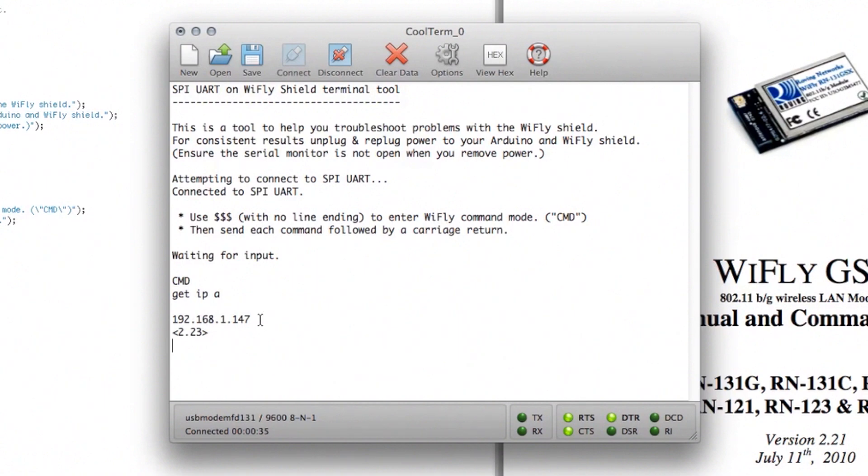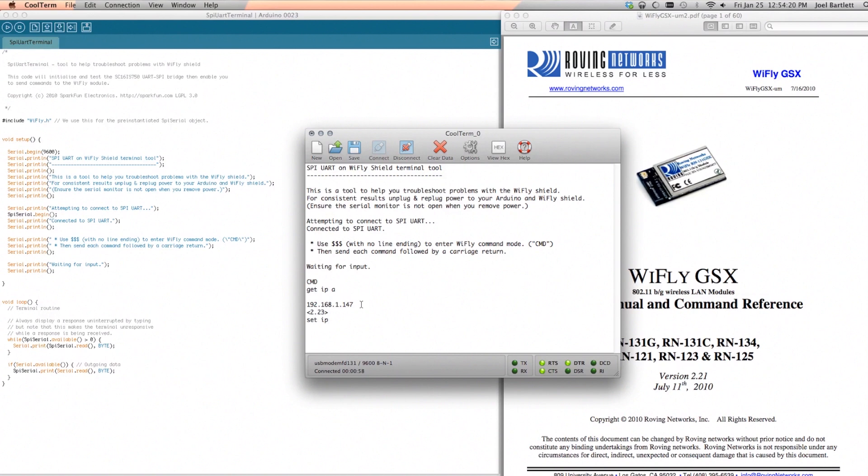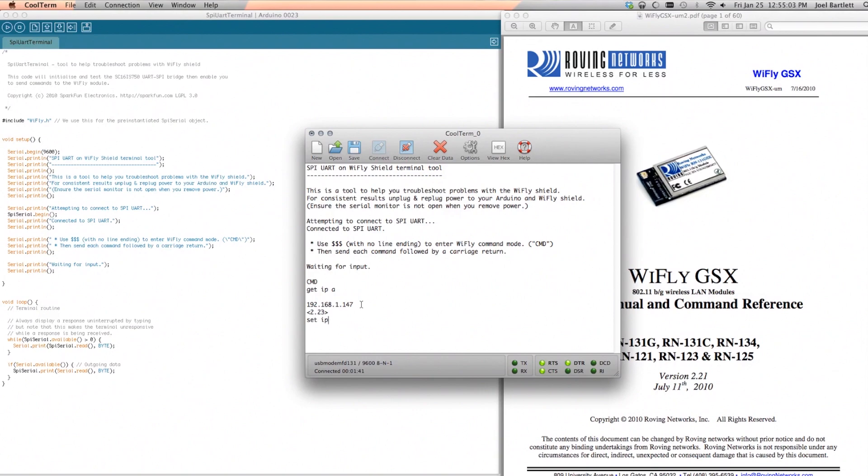As I mentioned, this is also on a different port. In order to change the IP address we're going to use the set command. When thinking about setting the IP address of your device, it's important to note that on most home wireless networks IP addresses are usually dished out automatically by your wireless router. Different devices will receive different IP addresses after they are powered down or disconnected and brought back to your home network — this is because IP addresses are constantly reused. There are not enough IP addresses for all devices, so when one device quits using one the rest are stored and shared. So I made sure to pick an IP address that I was certain wouldn't be shared with another device on my home network, using the set IP address command.